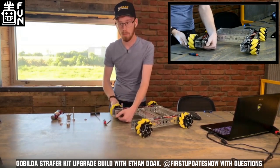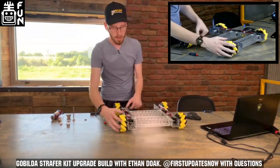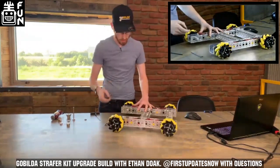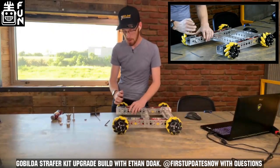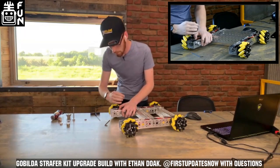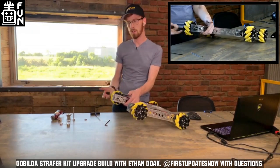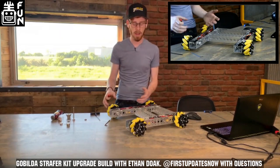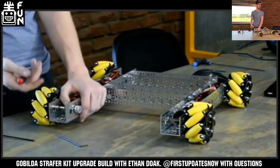This sounds fine — you can run this on a chassis. It's not quite as smooth as I'd like. I'll back the bevel on the motor off just a tiny bit and crank down the set screw. I've got a little more backlash now, so if I'm running odometry encoders I might not do that, but this gives a very smooth running system that I think will last really well.